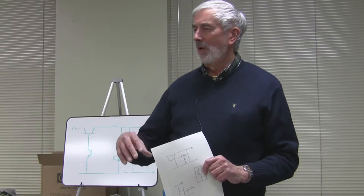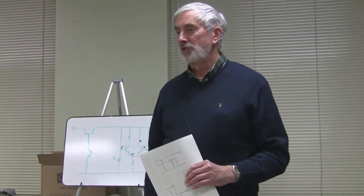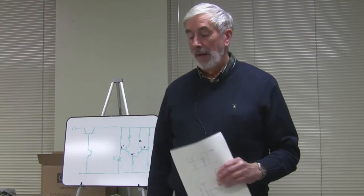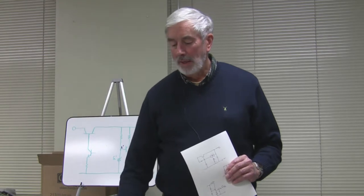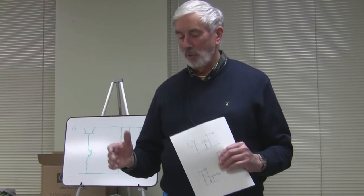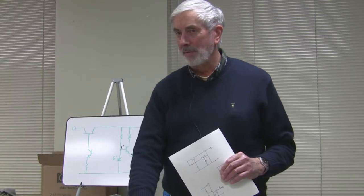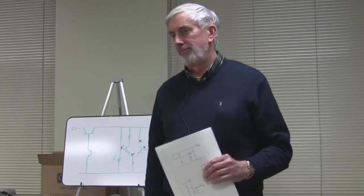The circuit that's in this one — and also in this one, I did open it and look — is much more modern. This circuitry runs like a 7815 regulator chip, where all the circuitry and the pass transistor are in an integrated circuit. It looks like one three-legged power transistor bolted to the bottom of the case. It's not just a transistor — it's like a 7815 — and it puts out 14.7 volts. Then there's a protective diode so you don't get voltage going back the other way, and the final output after the voltage drop is 14.3 volts. All these diodes, including the protective diode on the output, are ordinary little rectifier diodes only good for one amp, so don't try to run two amps out of this.